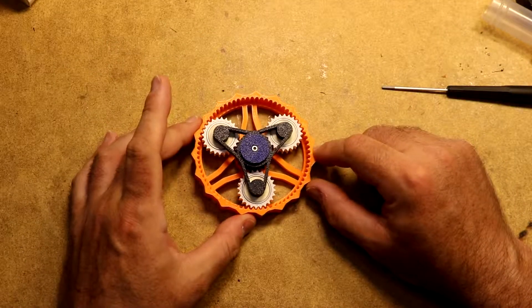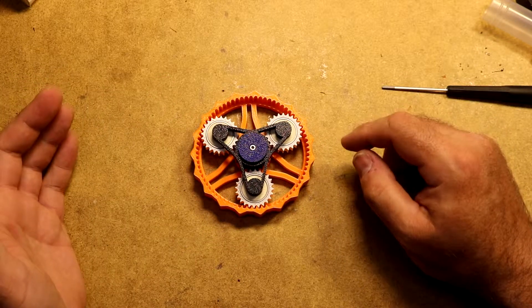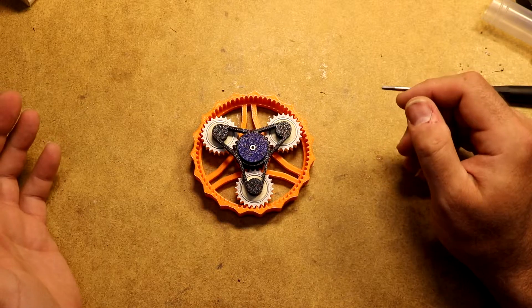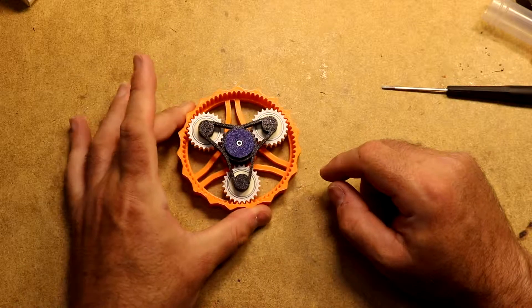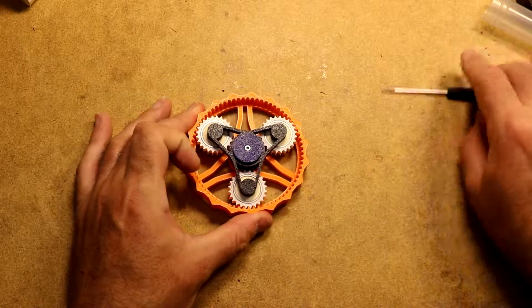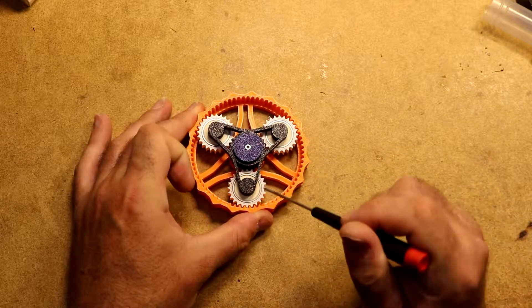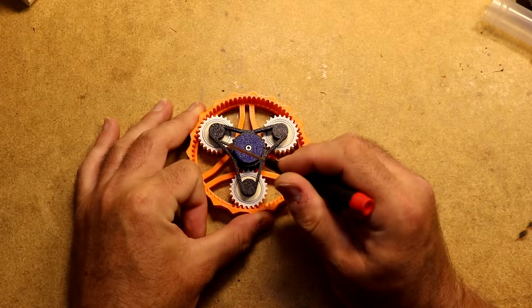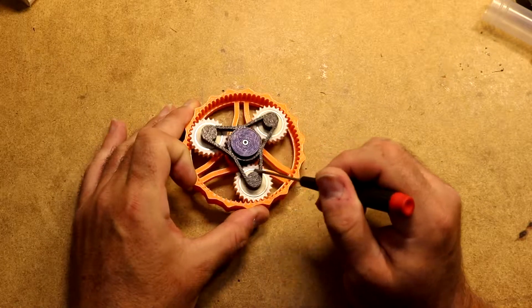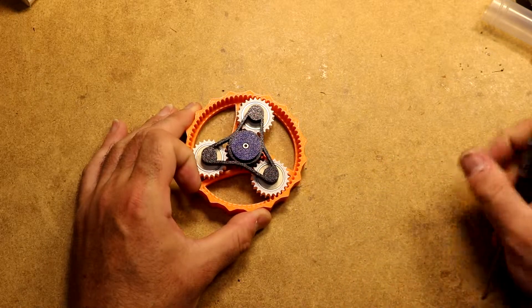So this is a planetary gear. Planetary gears are very popular on Thingiverse and a lot of people find the mechanism easy and fun to build. How a planetary gear set works — there are three main rotating assemblies. In the middle, this blue gear in the center is the Sun gear. It's surrounded by three white planet gears, and they are connected to the planetary carrier, which is this black part. And then finally on the outside is the ring gear.